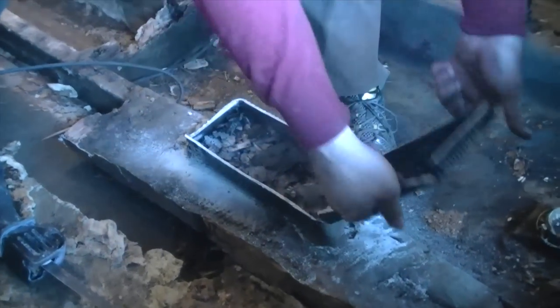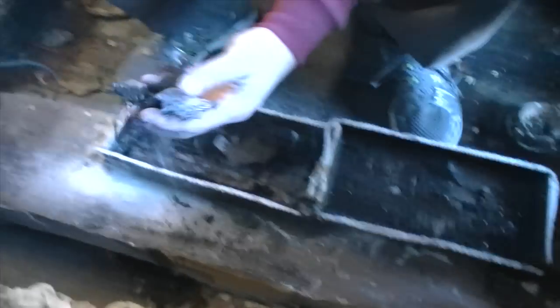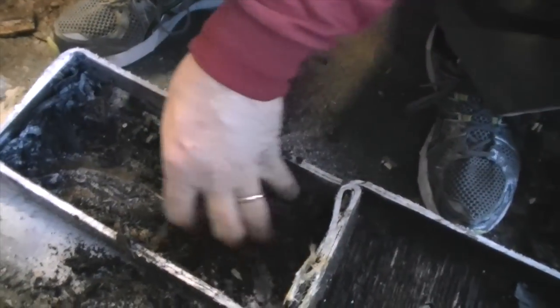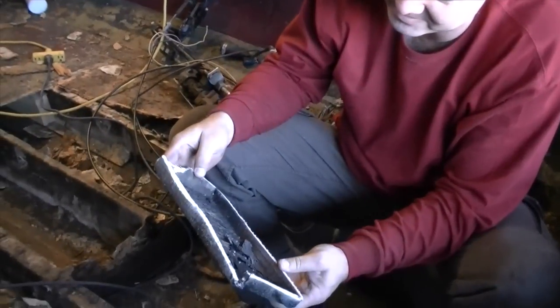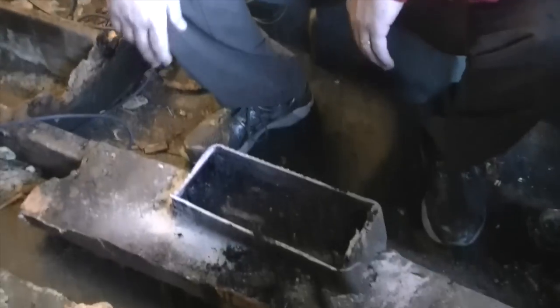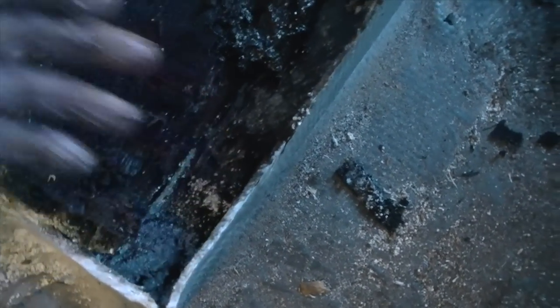Let's see how rotten it is. Wow — looks like paper in there. It is paper. Looks like a two-by-six at one point in time, but it was something that was just fiberglass holding this in. That's just amazing. It's wet — really wet. Here is some interesting stuff to see — look at this, see it jiggling? There's water in the motor mounts just hanging out there. This is why you have to seal everything so well. It's just mush down in there — all it is is mush, just standing water.